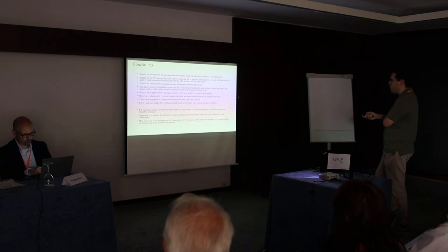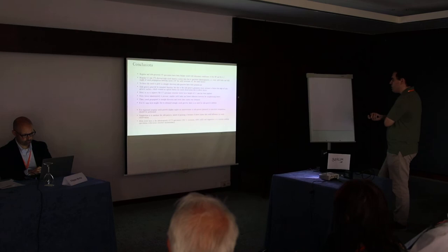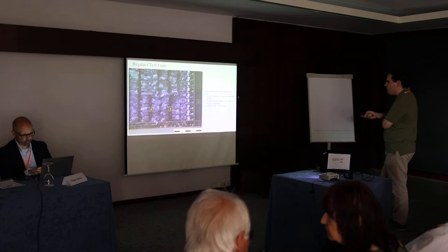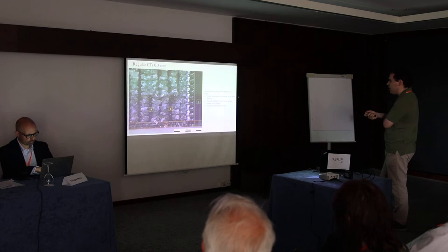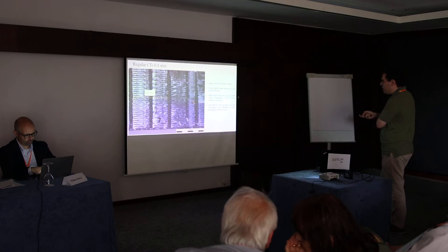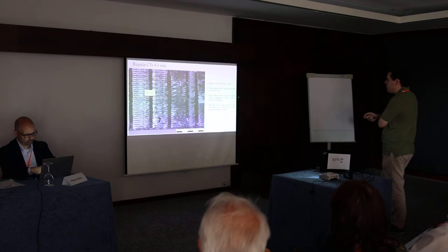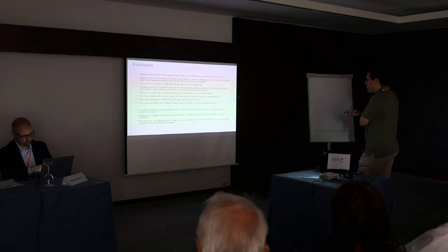The next step was to create finer CT specimens, so we reached for the highest precision on our 3D printer, so 0.1 layer thickness. Here we have smaller infill holes, and also, I'll show the previous slide, better adhesion between layers. So in 0.3, you see how the layers differ from each other. You can see different layers, but in 0.1 there is better adhesion between layers. In this crack propagation area, you don't see clearly the difference between layers. So the adhesion was quite a bit better, and there was better homogeneity of the specimen.